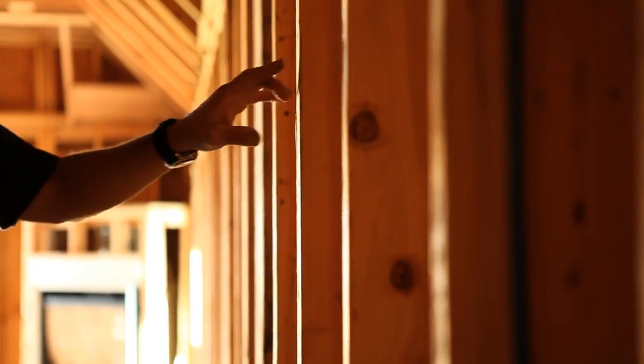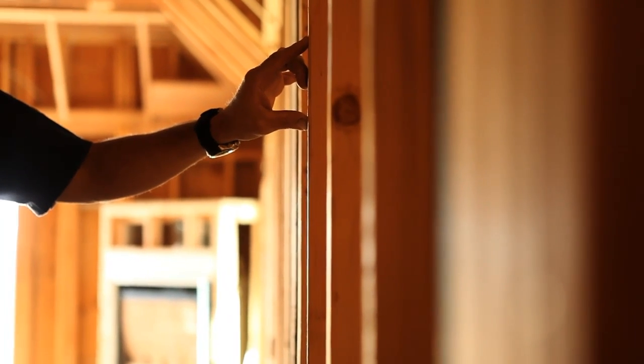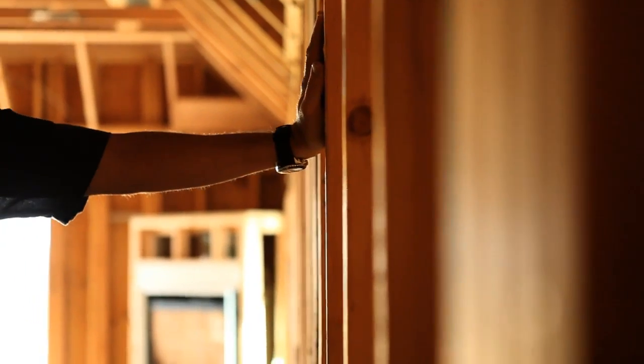And really what that means, like with this wall, if you were standing over in that doorway and looking down the length of the wall, as you start to bring your eye into line with that first stud, the studs starting back to front will start to snap into a single plane. And if the wall is completely straight, by the time your eye is just level with that front stud, you'll just see one flat plane down the wall.